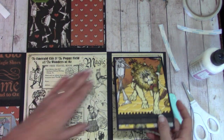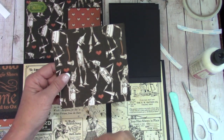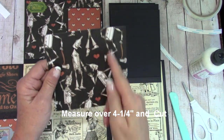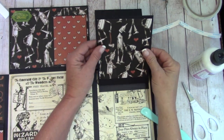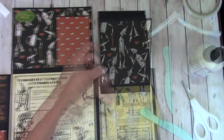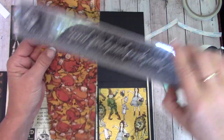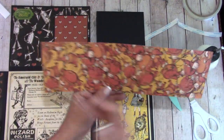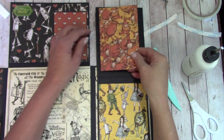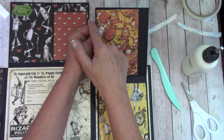We're going to flip that up and start right here. This one in our reserves — measure over four and a quarter inches and cut. Apply glue and bring it as even as we can top to bottom and glue that down. In your reserves, you will have this twelve-inch long piece, only three and a half inches wide. Measure over five and a quarter inches and cut. We're going to be placing a trim piece on the side, so apply glue, center that top to bottom, give ourselves a little bit of trim over here, and glue that down.